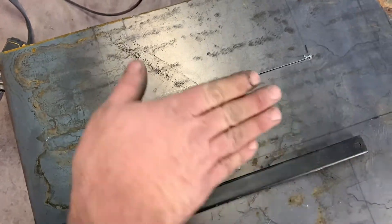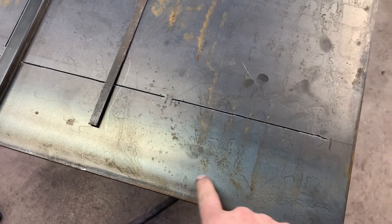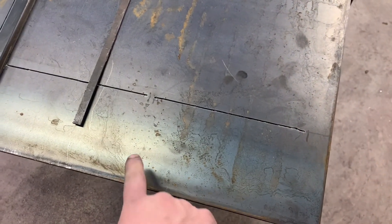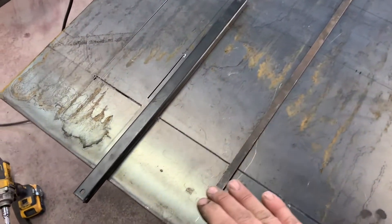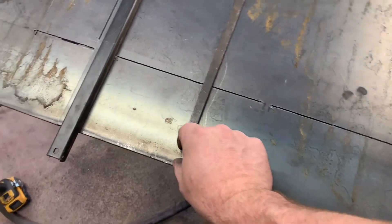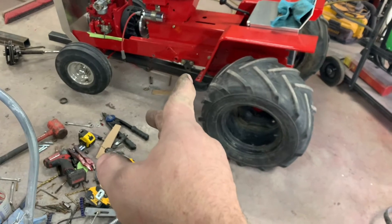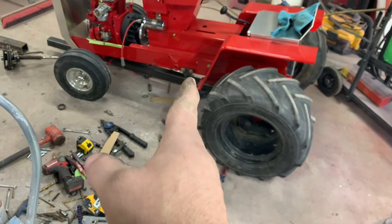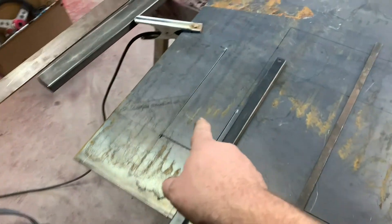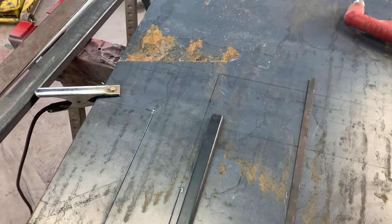Here are my fold lines. I'll have to take some measurements and cut a little notch so it'll bolt right to the bottom of the axle. We may have to trim a little off the top depending on how it lays with the frame. Then I'll build a bar across there with a hole in it — a weight bar to hang my suitcase weights — and make this tie right into the front of that. I probably should have left more material on that, but we'll end up welding something back on there.